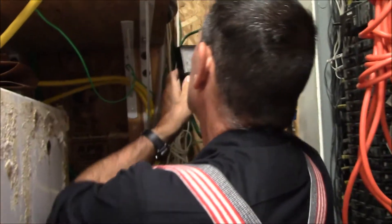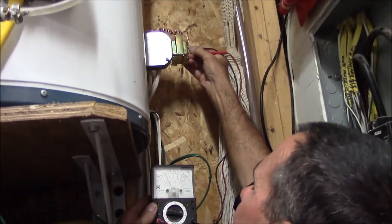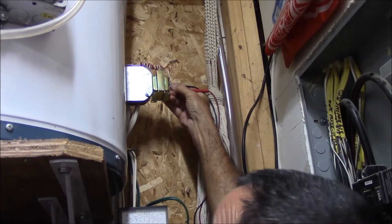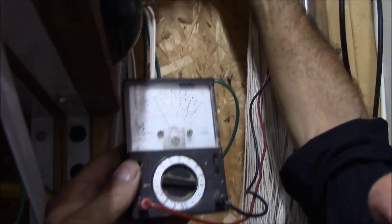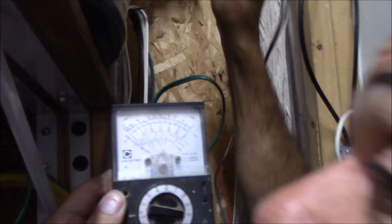Hi, I'm Blair Gilbert from MrHardware.com and Gilbert's Pro Hardware in St. Clair Shores, here to show you how to install an Alula video and audio doorbell. Here we are in the garage where my transformer happens to be. For most of you it's probably going to be in your basement near the furnace. Up here is my transformer, so I can check voltage here as well as outside. I can see I'm about 16 and a half volts.